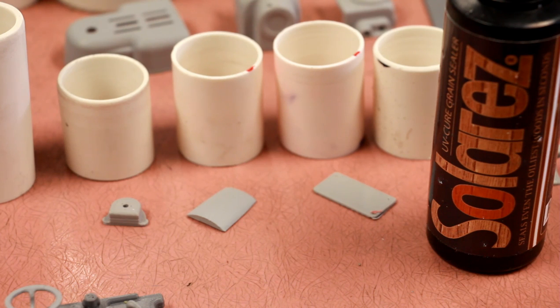For those of you familiar with the 1:19th scale 1911 I did a couple years ago, this was the exact same process I used. The only difference was I had such high quality 3D printed parts because they were printed on a $300,000 machine that I didn't have to do any touch-up at all - I just had to make the custom molds, make the RTVs, and shoot the waxes. With that said, let's go over and I'm going to show you how to sharpen a dental burr and convert it into what I'll call a miniature end mill.